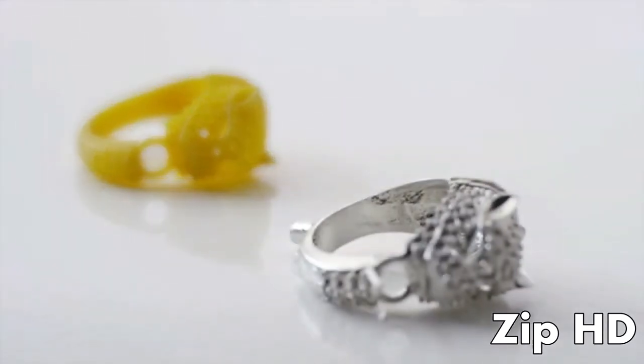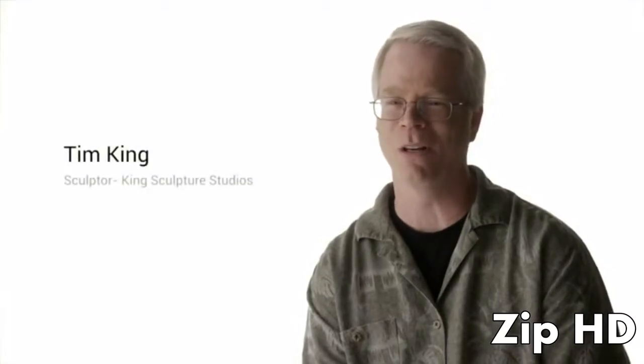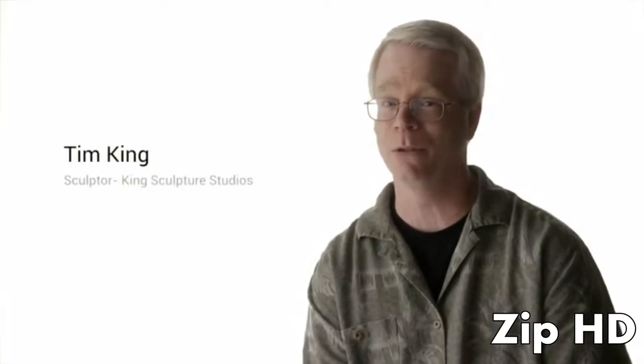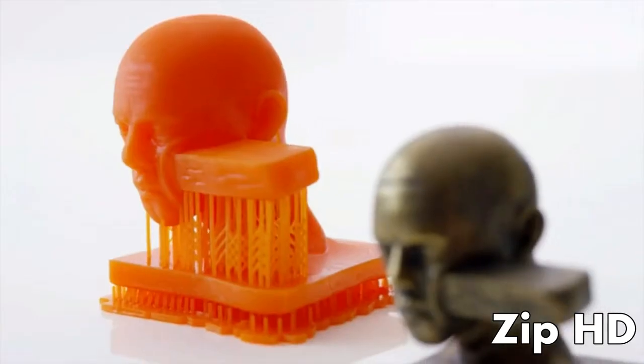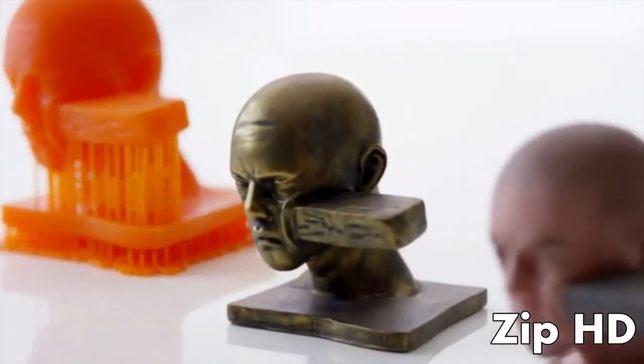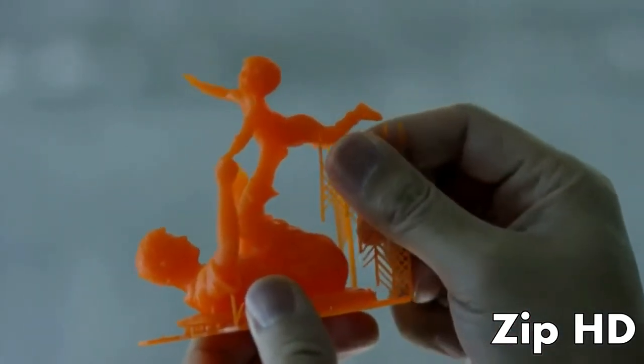What makes Moonray special and attractive, I think, is the resolution. I haven't seen that tight of resolution on a desktop SLA printer that's available for the price that it's at as well. There's always been a few different challenges in 3D prints. One is not only being able to have it smooth from the print or a lot of post-processing, and the Moonray allows me to be able to have minimal post-processing. And then also the support structure usually creates a lot of different points on a 3D print that have to be cleaned up later, and in this case it was very easy to do.